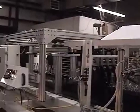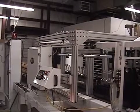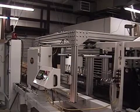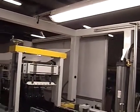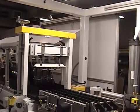The servo lane divider unit is easily programmed to change the number of bottles from one pack pattern to the next with up to 8 lane capability. We have an Allen Bradley touchscreen with a teaching pendant to easily change from one job to the next. Visibility in the grid area has been greatly improved by the addition of the overhead fluorescent lighting assembly in the change parts area. This allows the operator to properly see when setting up or job changing the packer.